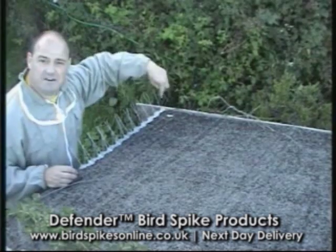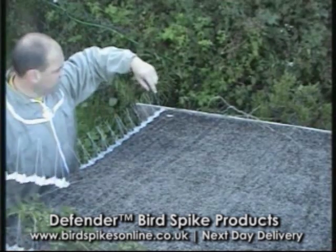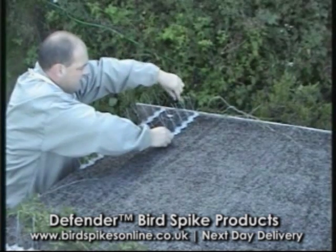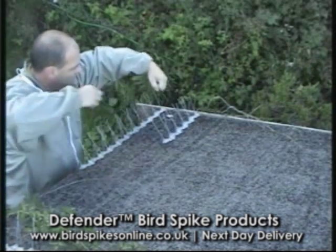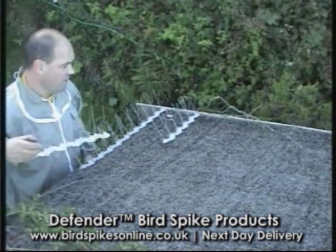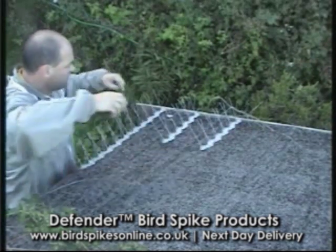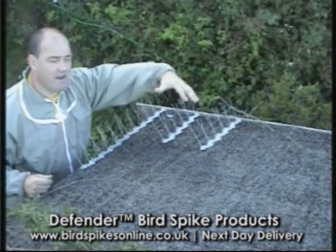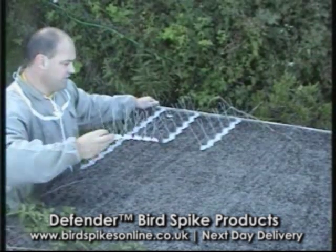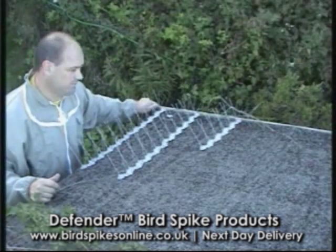Then as a rough gap, you can leave a gap of about 2.5 inches from the tip of the spike. A pigeon's not going to go in there. So just as a rough guide, I'd put my fist like that, and then I'd put my next row down. And I want to leave a gap here of about 2.5 inches, so I can only just get my fist in. And then you would need to carry on going along. However wide the ledge was, you'd have to keep going, leaving a 2.5 inch gap between each row until you'd covered the whole area that needed protecting. And obviously I would go along this way as well until the whole length and the width had been protected.